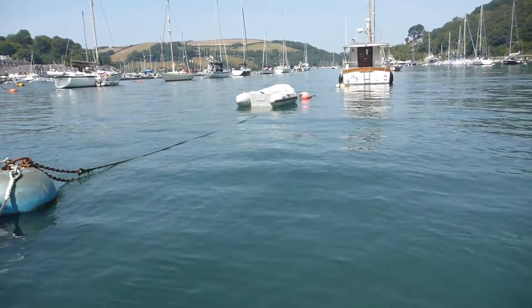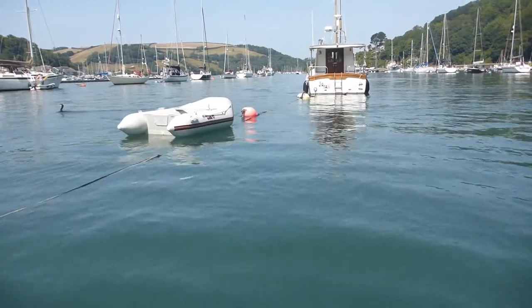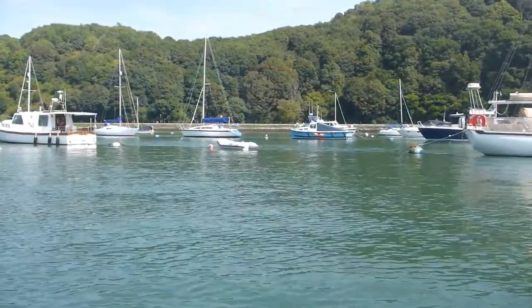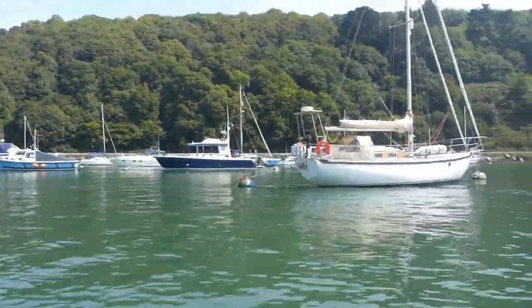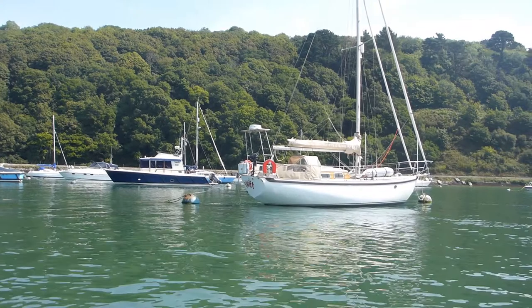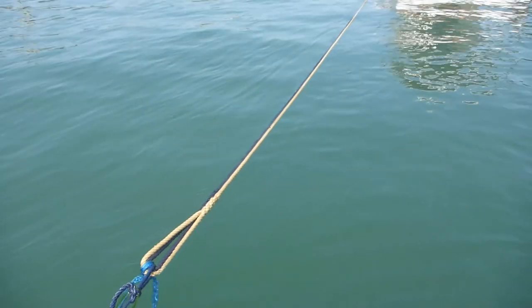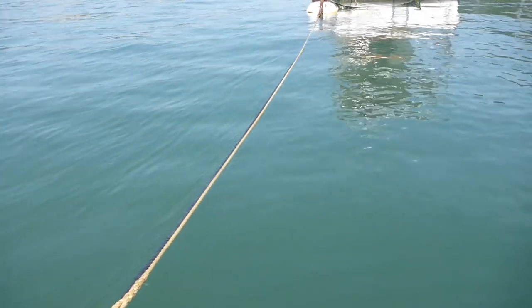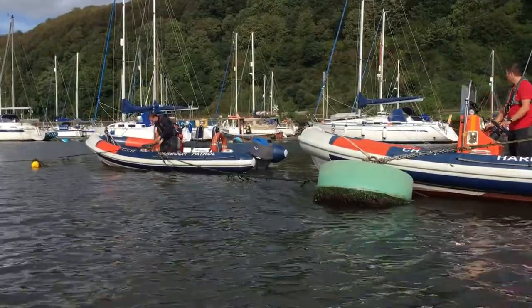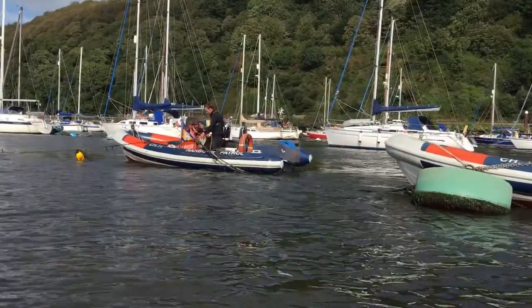Here's what happens if you don't leave one tight and one loose line: both mooring lines have been joined with one connecting line and a buoy, and the two mooring buoys have now moved apart. This is a very bad thing for two reasons. First, the downstream trots get smaller and the last boat on the trot is in real danger of chafing her bows against the downstream buoy. Secondly, the two lines are now really tight, and if this was a mid-trot it would be impossible to pick them up — hauling five yachts against a 1–2 knot current is just not going to happen. Here two Dart Harbour River officers are shortening an over-long trot, requiring plenty of engine power to drag the buoy upstream while a colleague shortens the line.